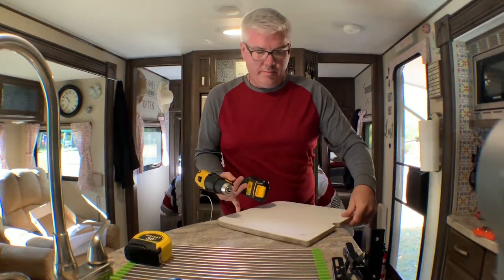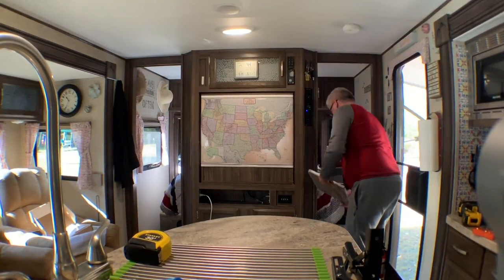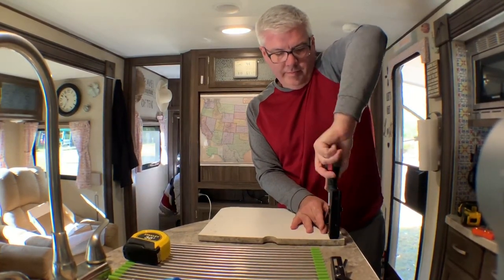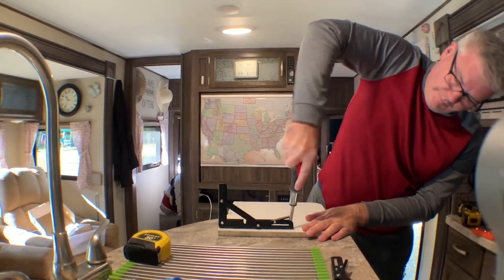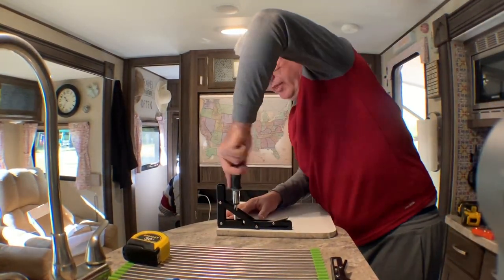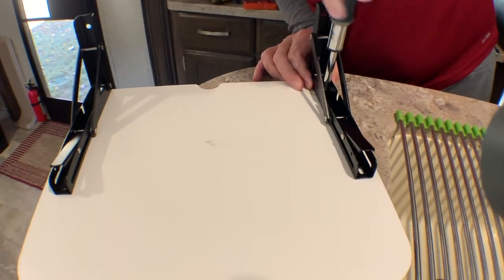Because of the covering on the panel, it really wasn't easy to get the screws in — we knew that from first experience with the failed shelf we put in. After pre-drilling all those holes, we just have to screw the bracket onto the shelf. This particular bracket had three screws that went into the shelf and two screws that went into the wall. There's the first set of screws in.